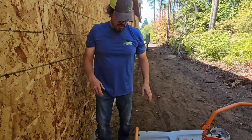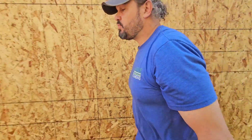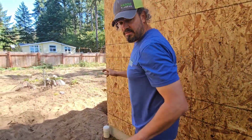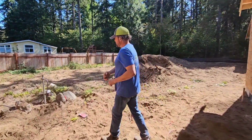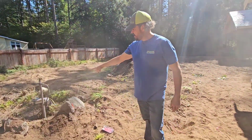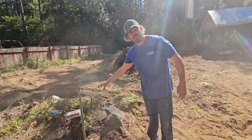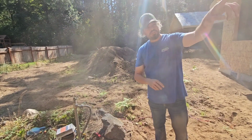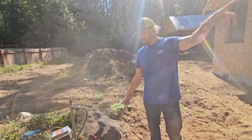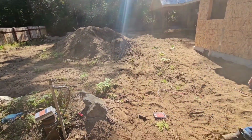Okay, so now I'm going to do that over here because this is going to fire off. And what I want you to see is once I fire that off, since everything's on and plugged in, we're going to have juice over here. So as soon as I fire that off, if you stay right here, you'll probably hear the humming of the pump. And then you can pan that way and you'll see it'll take probably about a good 10 seconds for it to come up the drop pipe through a 100-foot of hose and out that head. Okay, here we go.